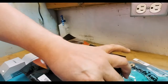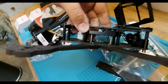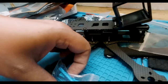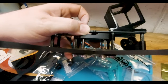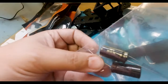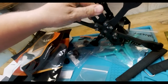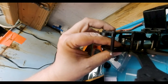The one thing you do break from time to time is the arms. Because I'm running the DJI system I need a bit more height, so I'm going to change out the standoffs. I got 35mm standoffs so when I have my stack on there I can fit the air unit on top. Since I'm running 6S I'm also going to use a 35V 100 microfarad capacitor - the big one - and that's going to go in the back area.